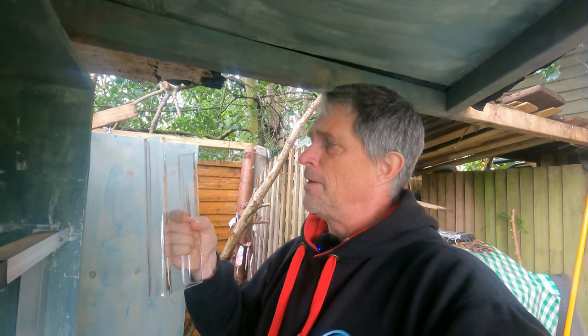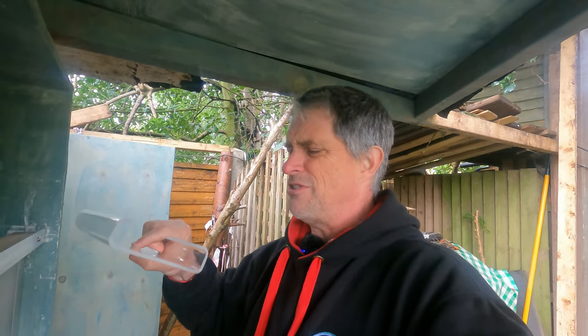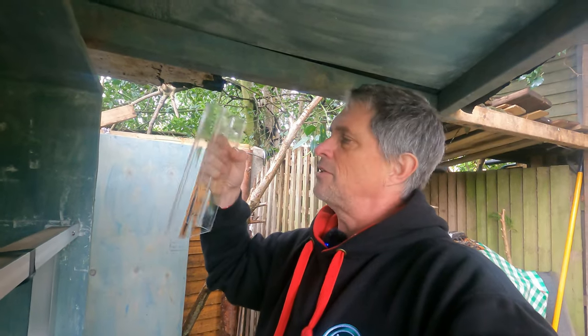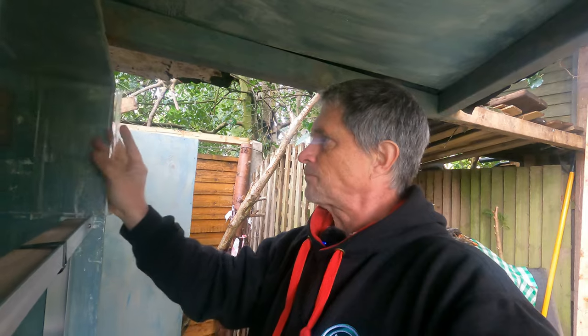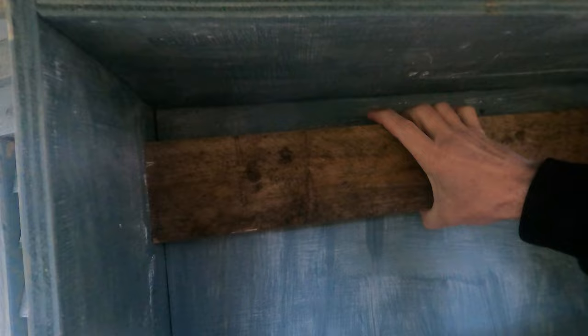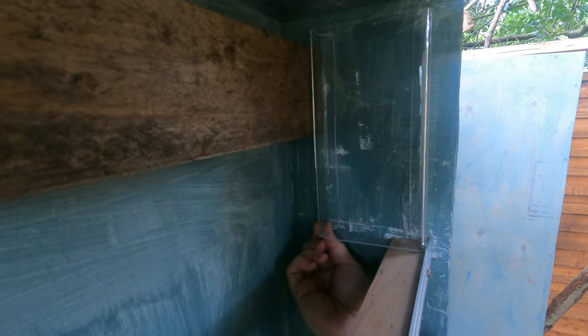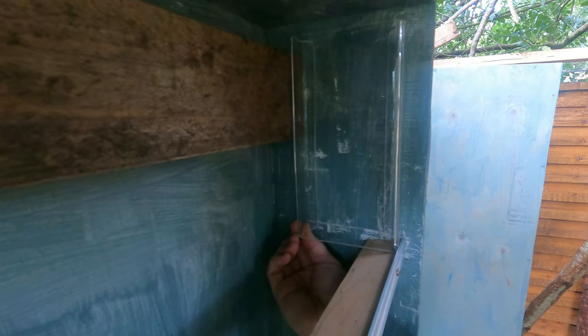I fabricated about half a dozen of these. I buy the acrylic as plastic window sheet for things like greenhouses and I chop it up. It's very difficult to cut with a jigsaw, but I managed to do that. Sand the edges and then I've got a jig to create the U trunk shape that the plastic forms. They're really quite robust. At the back here — this is not yet painted, and it's not fixed in — is a batten of wood with a space behind. The idea is I need to have a back support for these modules. They're basically supported at one point here and at the back, and with the cable coming out the bottom, they just sit there really nicely and stably without wobbling or falling forward.